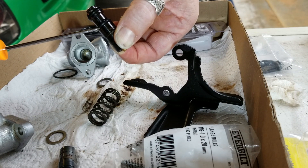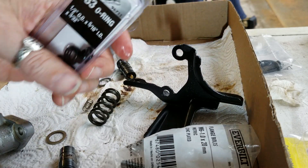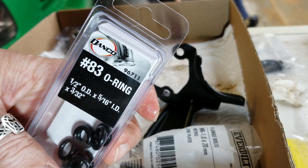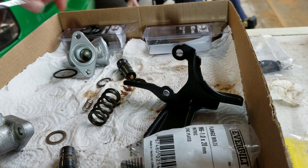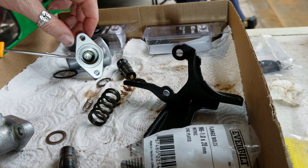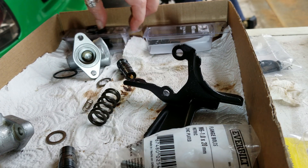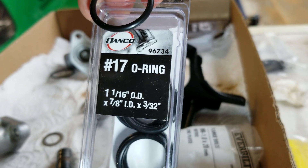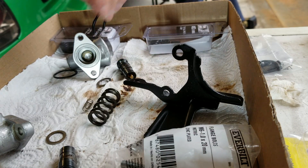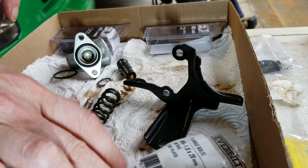This one I wasn't able to find an equivalent for, so I used the Danco number 83 O-ring — you see its dimensions there. And here, to seal the two valves together, or the two valve bodies, is this number 17 by Danco. It fits right in there.